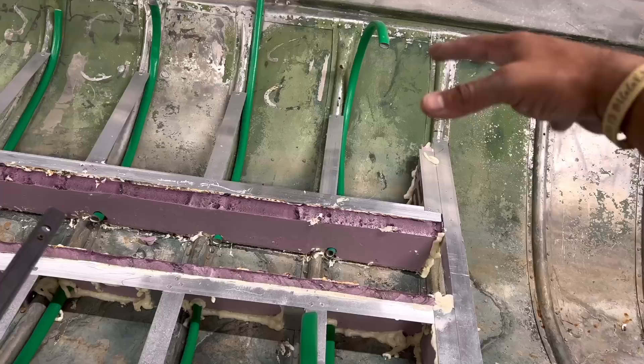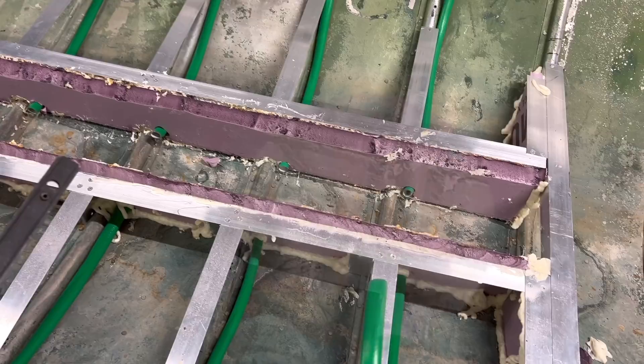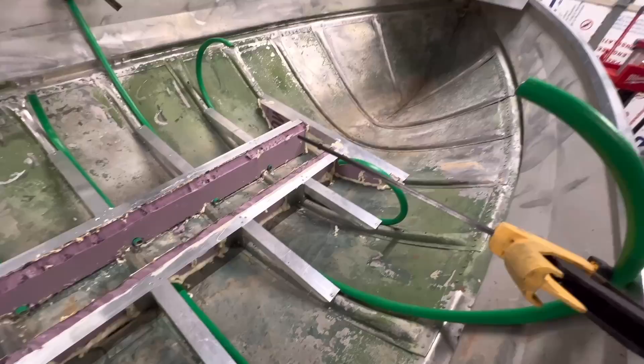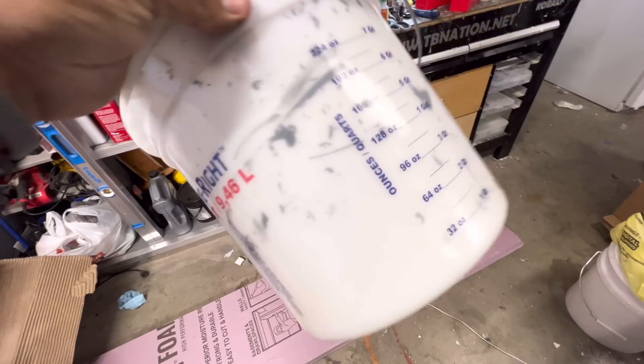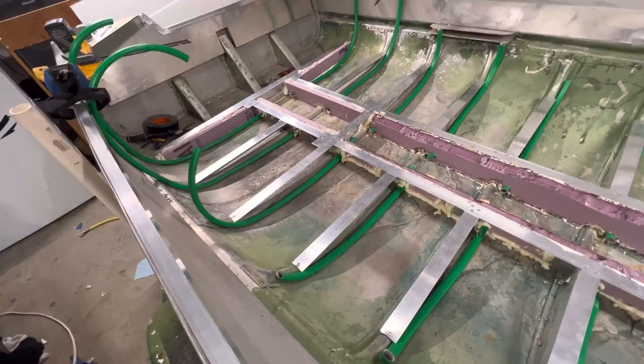Where are those foam pockets going to go? They're generally going to go right here where the rod locker is. We're going to seal the channel off even more - the middle is not done. The middle is consuming me. I'm thinking silicone and some other stuff is what we're going to use in between the crevices on the sides for a long-term solution. We're now ready to pour pockets of pour foam - the voids left over will actually be joining and it'll maybe be stiffer that way. See you later after we run the plumbing down the channel, clean that channel up, seal it off, and make some modifications to the inner ribs so water can actually flow through and not stagnate and ruin the floor.